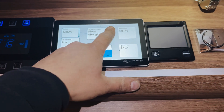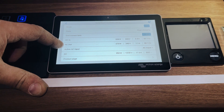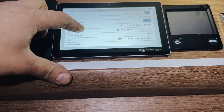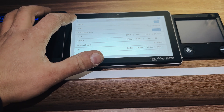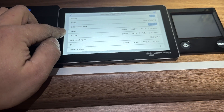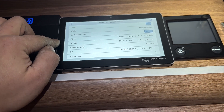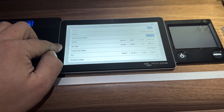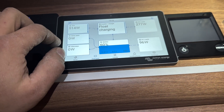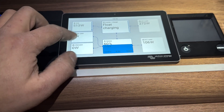We've currently got it plugged in and the MultiPlus is on a float charge. If we go into that, you can see AC in and AC out — it's busy outputting for the fridge there, going out on the AC out 2 port. So we can see that relay with the solar dump is working. The setting on this is that the fridge will be supplied when the batteries are at 50% state of charge or more. If the batteries drop below 50%, it turns off, the fridge goes to automatic changeover and switches to gas.